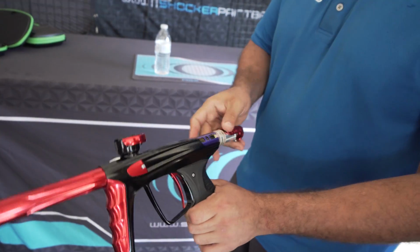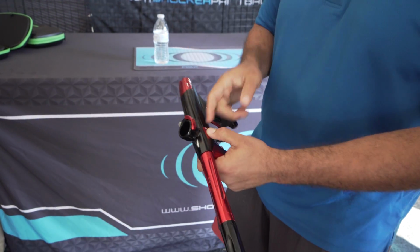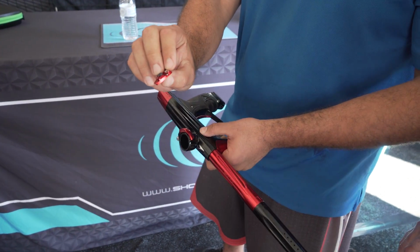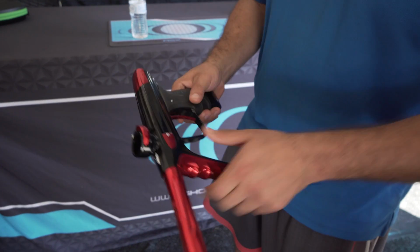What's the operating pressure? It's going to be about 100 to 130 psi. So we refined some things as well. So this is the Luxe X? This is the Luxe X. Okay. The detent system went away from the plunger style to our lever action style. Less grit to build up in there. The detents won't bind or anything like that. Snaps right back in place, just like all traditional Luxes.